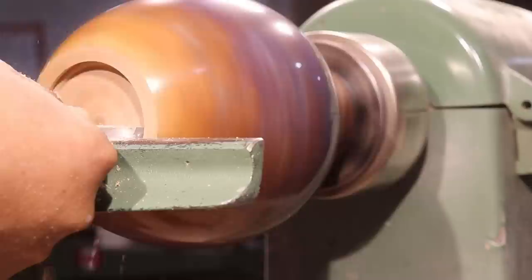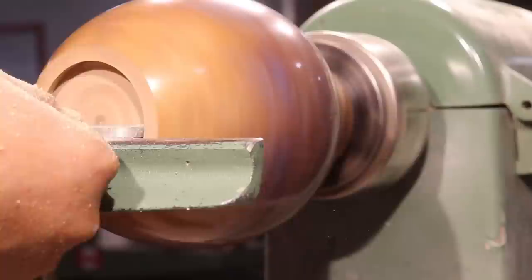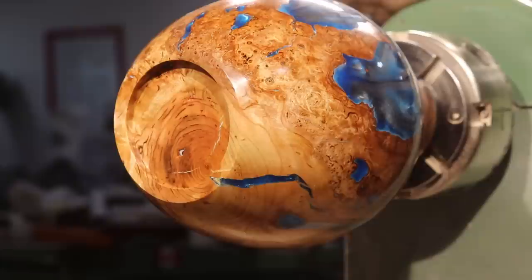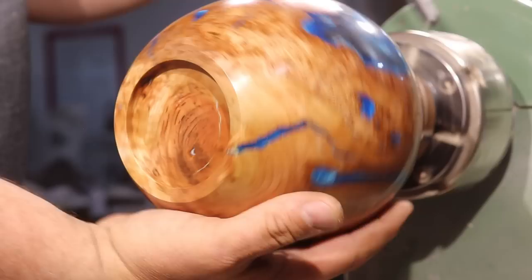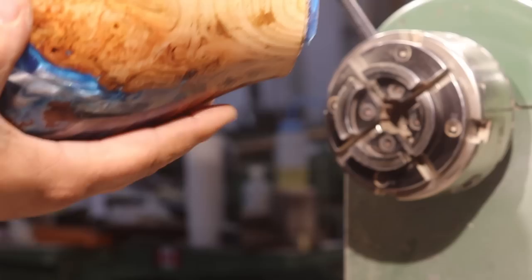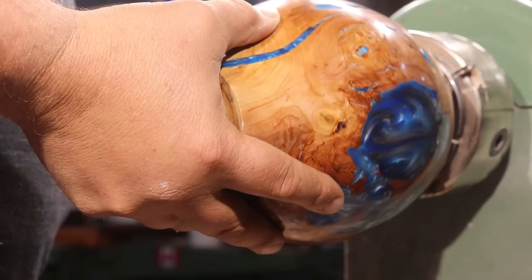I'm just finishing up the bottom — I'm going to finish turning my mortise and finish the bottom up. Here I am with my little dovetail tool, and you can imagine how excited I was to do that because I hadn't seen the footage yet to know what happened. I've got the bottom finished now with Yorkshire Grit Regular and Microfine, and I did put Hampshire Sheen High Gloss on it. As I take it out of the four-jaw chuck, you'll see that the resin had come apart from the wood — I thought it came off when it hit the floor, but after seeing the film I know what really happened.